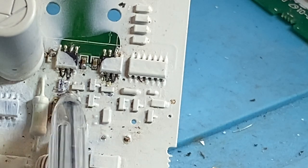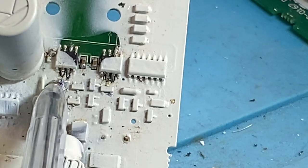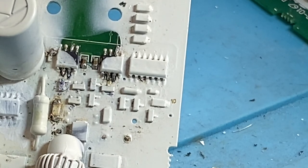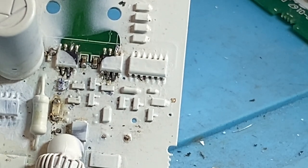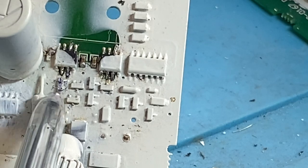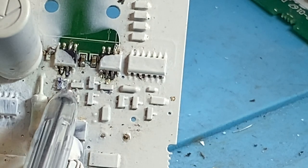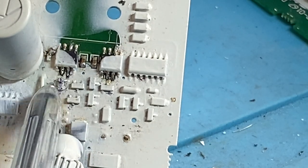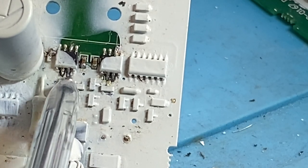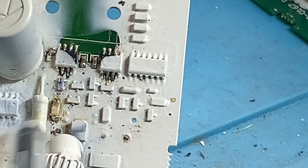And these dual gate MOSFETs, basically one MOSFET is left turned on, connected to positive volts on the gate, and the other one is switched on and off by the ADG, what is it, ADG333 on the other side of the board. And what that does, it supplies bias current to the op amps and also across the non-inverting and inverting. The 10K resistor, which is hidden on the back of the board, is very hard to find. They're very small, but I'll show you that in a second.